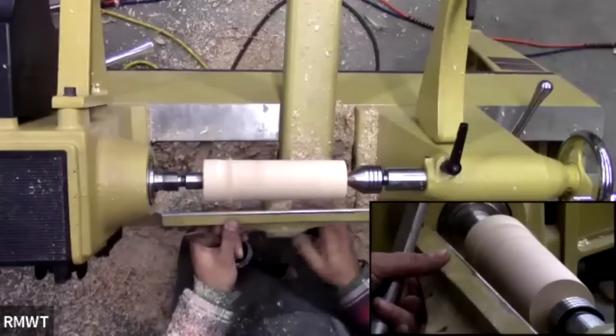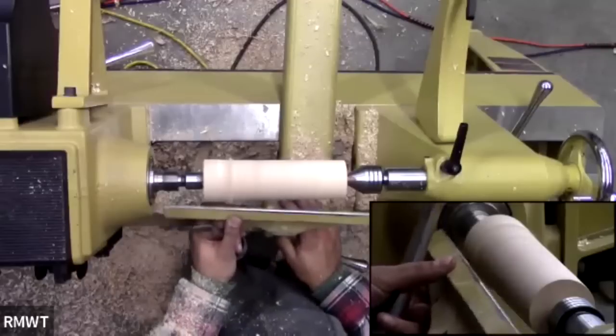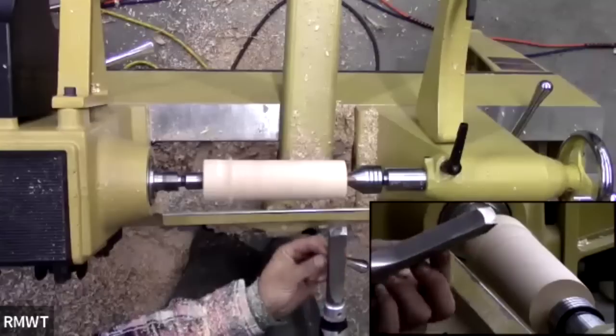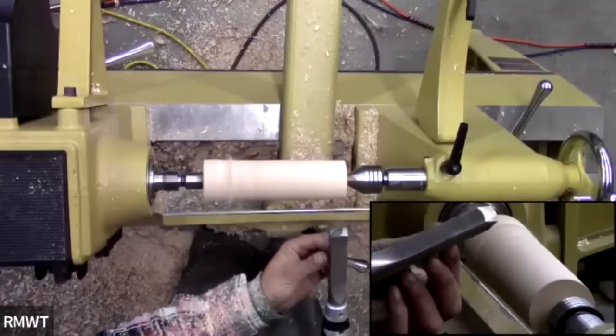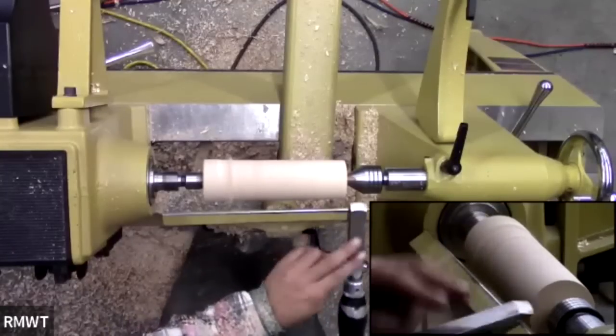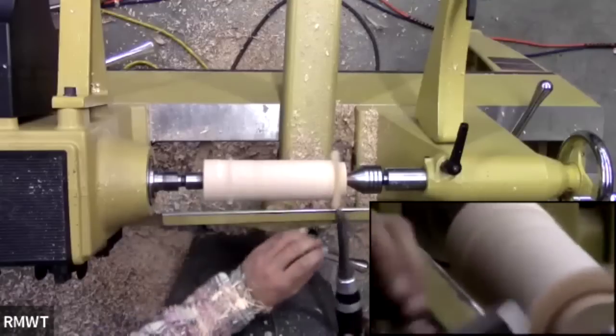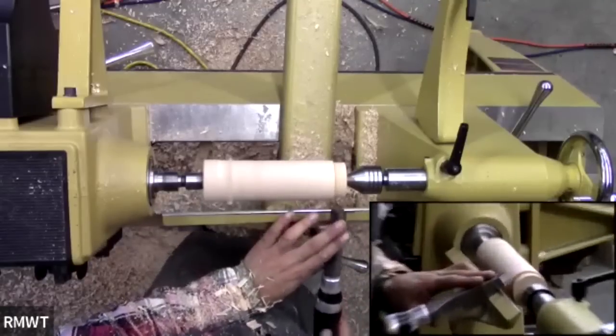And we'll talk a little bit more about what I was saying. But the trouble with an oval skew chisel is that it's convex. It's inwardly convex towards the flat bar stock this way. So you can't sit flat and make a peeling cut. So that's the trouble with it. And that would be a shear cut right there.